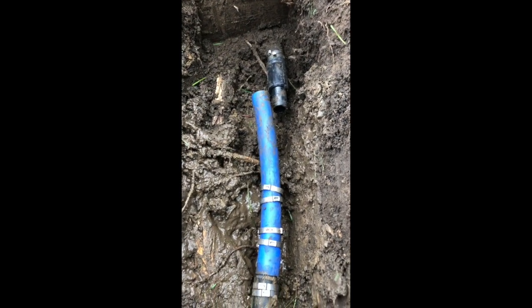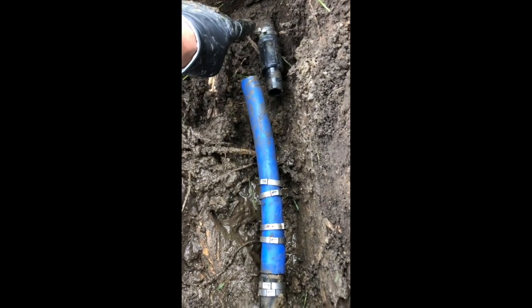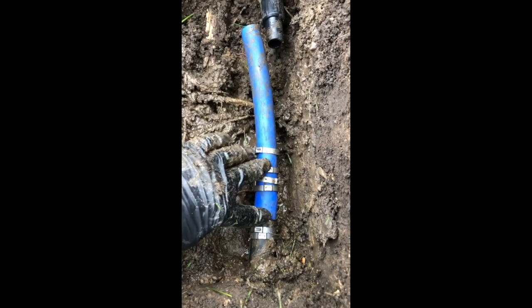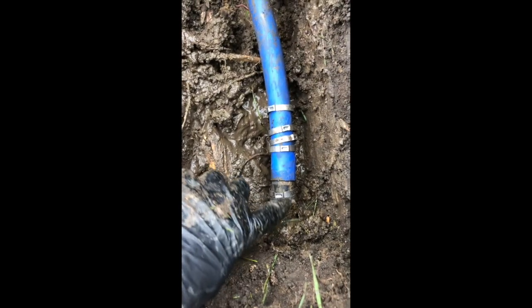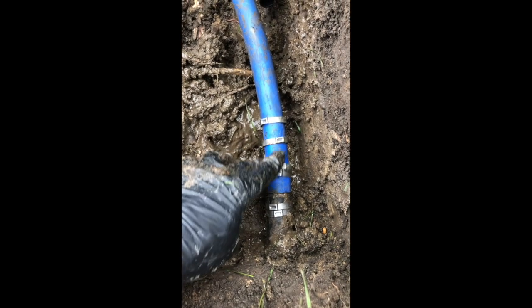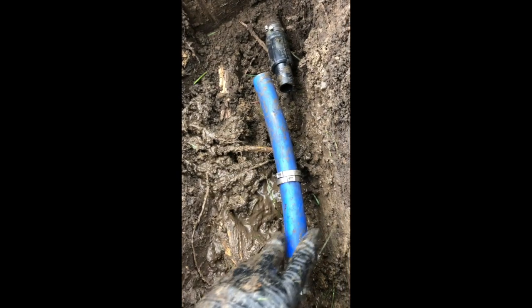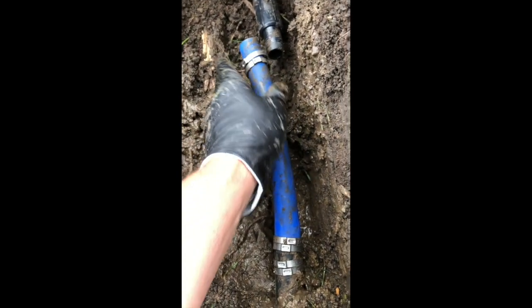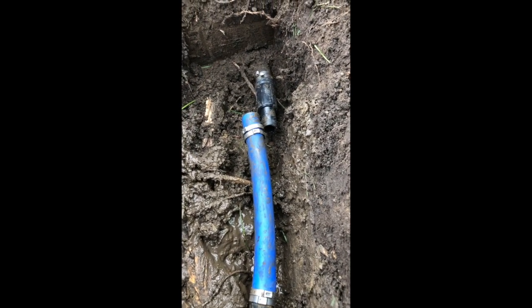As you can see here, I've put my poly slip right here with the two clamps clamped down. I have my new poly in here as a splice and I put that coupler in here. I'm going to clamp these down, pull these two down and clamp those. Once I get this all on, I'm going to clamp it down and put it right in there, and then we'll be able to run the water through and we'll see lots of water pressure.